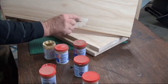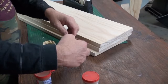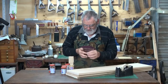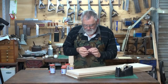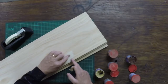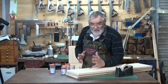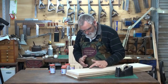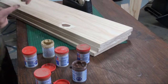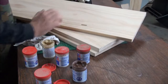A little bit of tape either side of where you're trying to fill — so I've completely surrounded the area with tape. I'll take a little bit of oak putty. This is water soluble as well, which is great — it doesn't dry your hands out when you're mixing it up. And the other thing I like about it is it actually retains its colour when it's dry; there are some that actually lighten when they dry. Now I'm pushing in there nice and deep. The other advantage of having the tape around it — see how messy I'm getting — is when you're done with it, you take the tape away, and that's all we're left with. When I sand that back, it'll be the colour of whatever the blemish was.